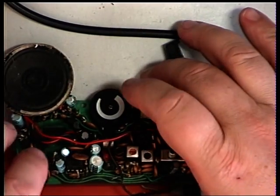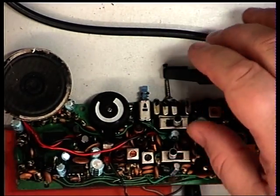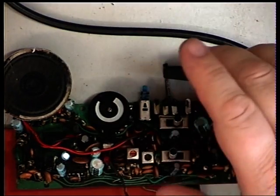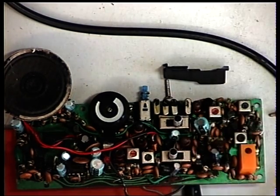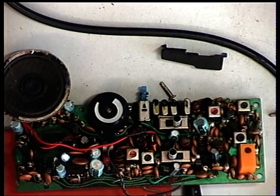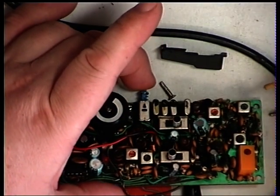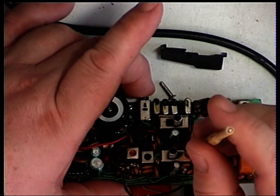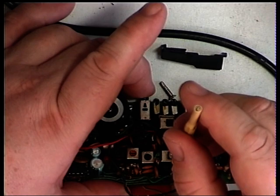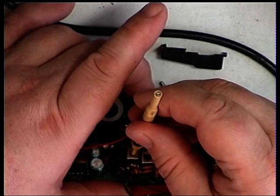We're providing nine volts from the bench power supply. There's a little battery test indicator which lights up, and according to the service manual, when the battery voltage drops to seven volts that light goes out - that's the criteria for that test. Transformer 2 is the first port of call for transmit. At the moment we are getting a reading but it's drifting down - it's doing 40 milliwatts but it's rated to 200 milliwatts.